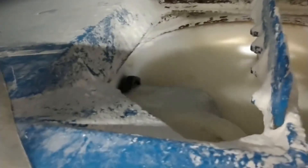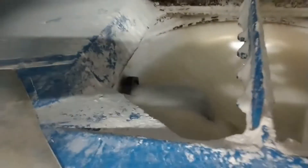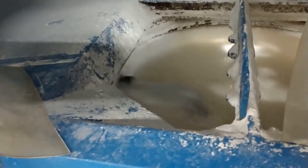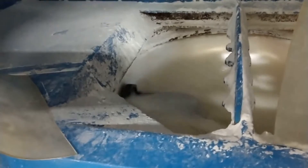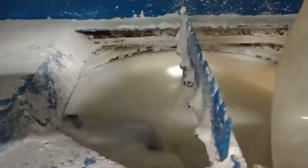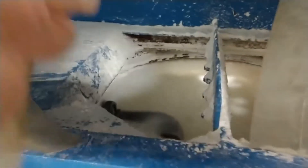This is the filter aid slurry tank. We have it under agitation. There's an overflow pipe here, so we're basically just overflowing the slurry. At the point in time when we build the full cake, we'll be done with the pre-coat process, and we'll turn off the overflow and turn off the mixer, and then we're done with the filter aid.